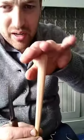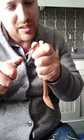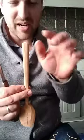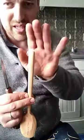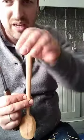Sorry, I just kicked the tripod. I took the time to be really good about rounding this nicely before I started doing this little bit, because again, similar to getting nice square sides on your handle, the more you can set up everything to be even in one plane, it means that you can then round it in this plane and have it still look even in this plane.